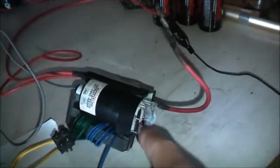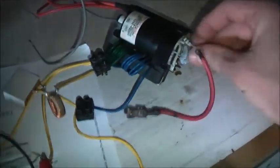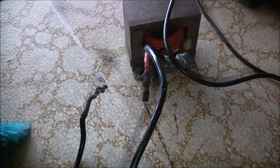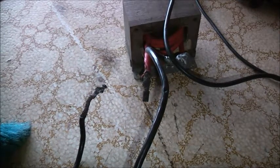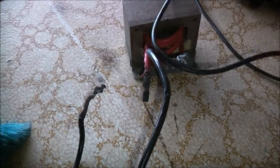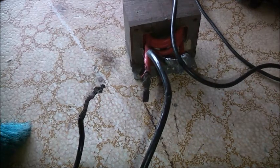Discharge that pin there. Not the hard way there. Let's take this blue tack off, see where it arced. And let's do a proper test of AC amps instead of DC amps. This would be a better way to do it. I think this is actually only an AC amp meter, so pretty good for what I need it for. Let's put this on, straighten it out, see what reading we get.